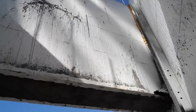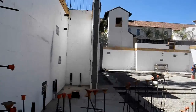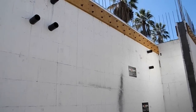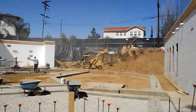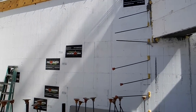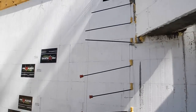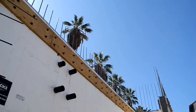The cool thing about the below-grade work: on the backside of this is a waterproofing membrane and then a dimple board peel-and-stick with a filter fabric on it. That covers below-grade work, retaining walls, and basements — big basements — at a lower cost per square foot to install. These walls are already all furred out; everywhere you see this logo is an inch and a half stud to sheetrock. This will be a LEED Platinum effort in Redlands, California.